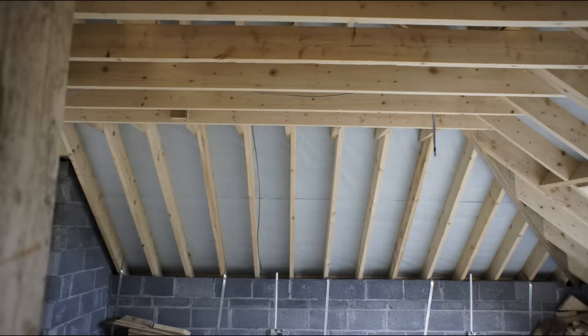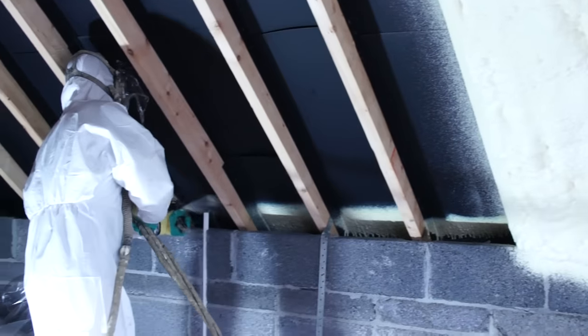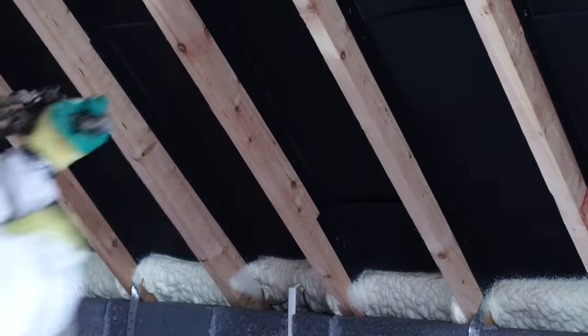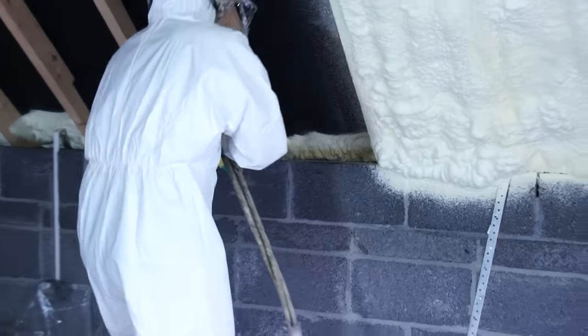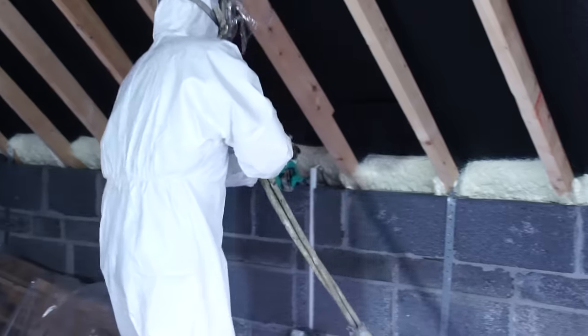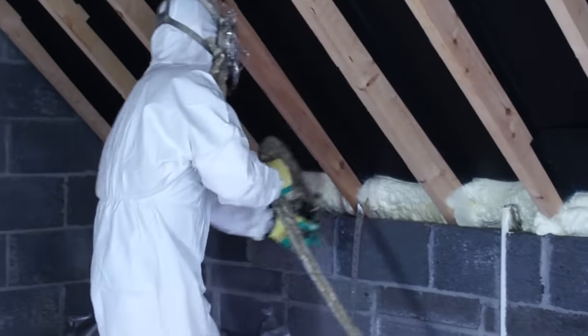This video will deal with the insulation of a typical dormer roof construction. Before the spraying starts, we fit a certified Vint spacer system along the sloping rafters. This has the benefit of creating ventilation behind the airtight wall of foam that is to come. Here in this video, you will see the spacer system in black onto which the foam is being sprayed.